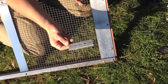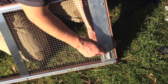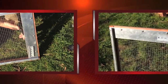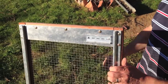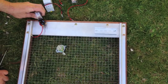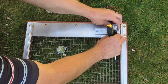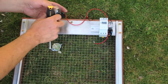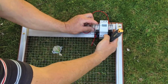The next thing we want to do is get our DIN rail. I've just drilled a couple of holes and I'm going to pop rivet this on to the side. All we have to do is connect these relays — place them over the top, pull the pin and they connect on there rather nicely. Then we place the timer unit on, connecting it in the same way, and then the next relay switch sits over the top and connects in the same way. Push them together and make them nice and snug.